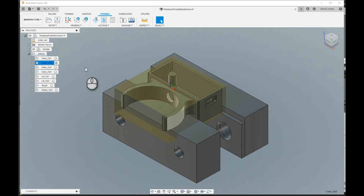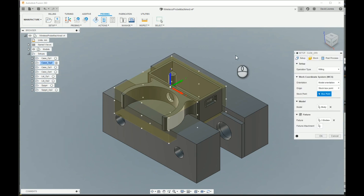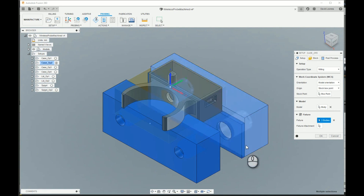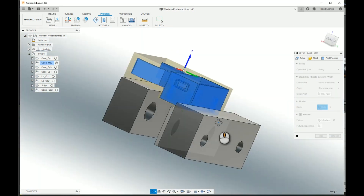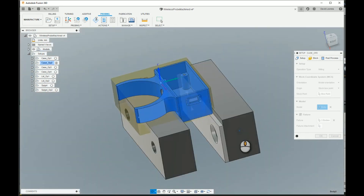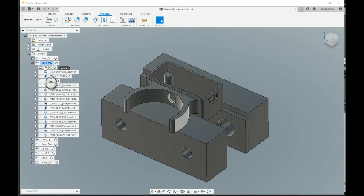It's another neat feature of Fusion to show us exactly what Op 2 is going to do and what's selected in the orientation. The thing that's different here is I spent some time adding the fixture - basically two soft jaws and a parallel. In my setup for Op 2, I've clicked the fixture and selected the three bodies that make it up: the two soft jaws and the parallel. Our model is sitting on that parallel as it should be, done at the design stage. I've again created a folder for probe operations, and this is where we can get a little bit more creative.